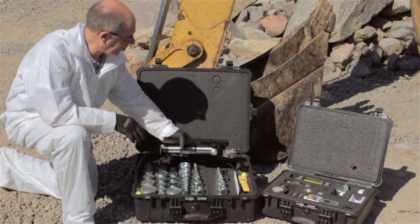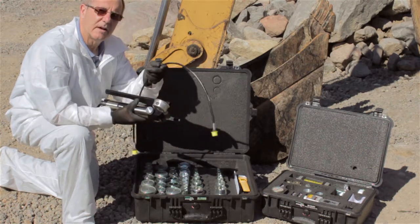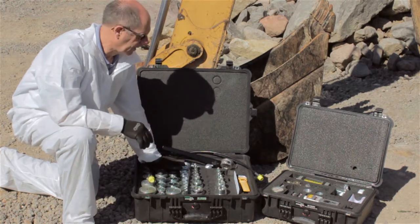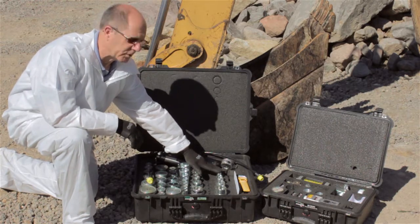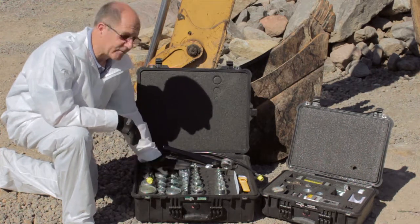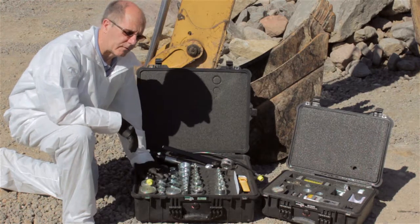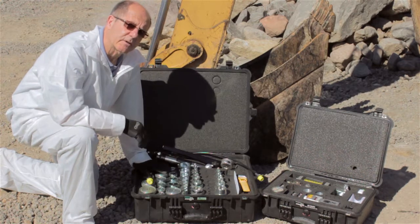To do this procedure we need a micro leak test kit available from HydroCheck. The kit consists of a micro leak test pump, a pressure gauge, and a four millimeter transmission line that connects the pump to the suspect component. It has all the adapters you typically need to test almost any machine in the field: male pipe adapters, male O-ring SAE straight thread adapters, JIC adapters, code 61, SAE code 62, and special code 62 fittings for some Caterpillar equipment.